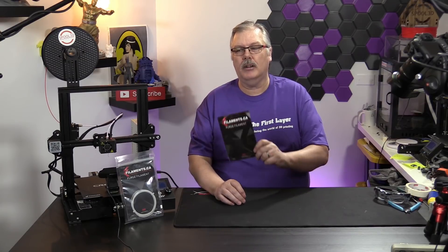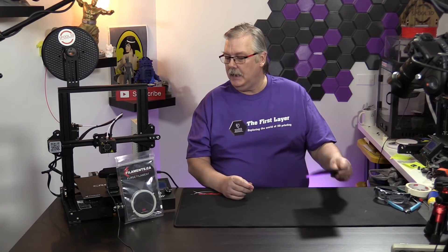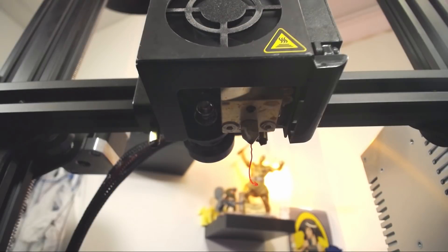Let's go ahead and start with the printer. It says set the temperature to 175°C. So let's turn on the printer. We've got a nice camera shot of the extruder here. You can see we've got a nice little camera underneath our extruder. I do not have a sock on this particular printer. I usually do about 180 to 200, so I'm going to split the difference and heat this up to 190 — actually, we'll go with the PLA default setting at 185.